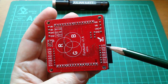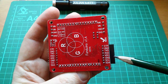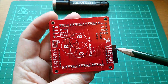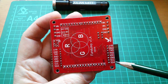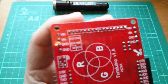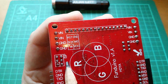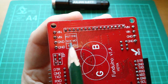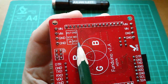We have DTR, ground, TX, RX, and VDD — that sounds a little bit like the five pins used for Arduino-style USB-to-serial connecting. We've also got another ground, SCL, and SDA, which sounds like I2C. There's also a standard ISP in-system programming header with pin 1 as MISO, MOSI, SCLOCK, RESET, GND, and VCC — the standard arrangement.